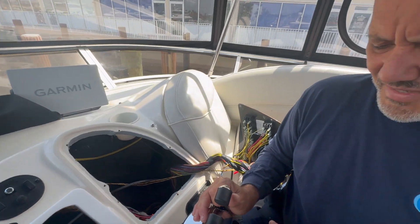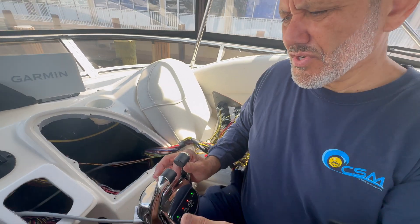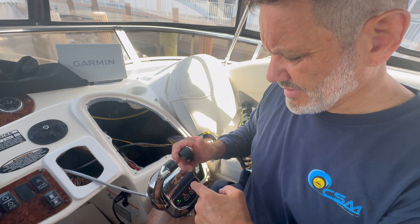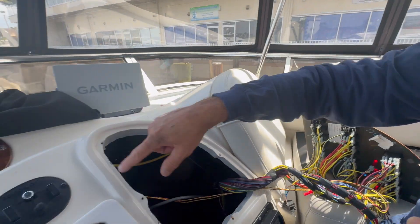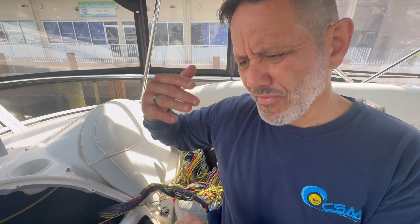If we take the warm button off, we're able to shift. We're going to put port into forward and starboard into reverse. Shifting capabilities are correct. The cables come labeled for forward and reverse, so if the transmission is labeled with forward and reverse, all you have to do is unplug it and connect the DIN cables to the transmissions. Everything is ready to go. We didn't disturb any of the original wiring of the boat — everything stays original. It's a plug and play. If you have any questions, please let us know in the link below. Like and subscribe!